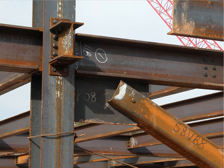So this is a classic wide flange section where we have a top flange that's strong in the horizontal direction, a bottom flange that's strong in the horizontal direction, and a web which is strong in the vertical direction. Where these things connect together, where the top flange connects to the web, for example, the top flange stabilizes the web laterally, and likewise the web stabilizes the top flange vertically. And we have a similar interaction down at the bottom, where the bottom flange stabilizes the web against horizontal movement, and the web stabilizes the flange against vertical movement. Now, this is a classic application of this notion of mutually bracing sheets of material.